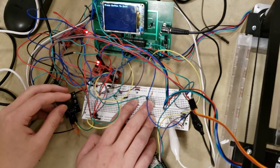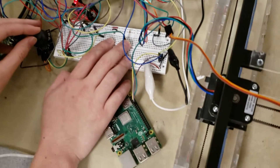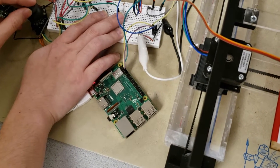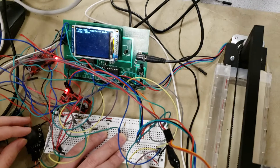We can see the IP address of the Raspberry Pi so that we can SSH into it. The Raspberry Pi is providing images and doing some image processing work to turn them into edge drawings. There's a Canny algorithm edge detector and then a curve/stroke generator.